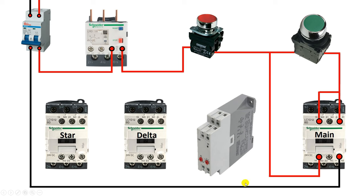The power supply which comes when pressing the start push button — the same power supply is to be connected with the timer. From the output terminal of the start push button, connect a wire and connect this wire with the A1 terminal of the timer. At A1 terminal of the timer you have to provide phase supply, and at A2 terminal you have to provide neutral supply. So from here I am providing neutral power supply.